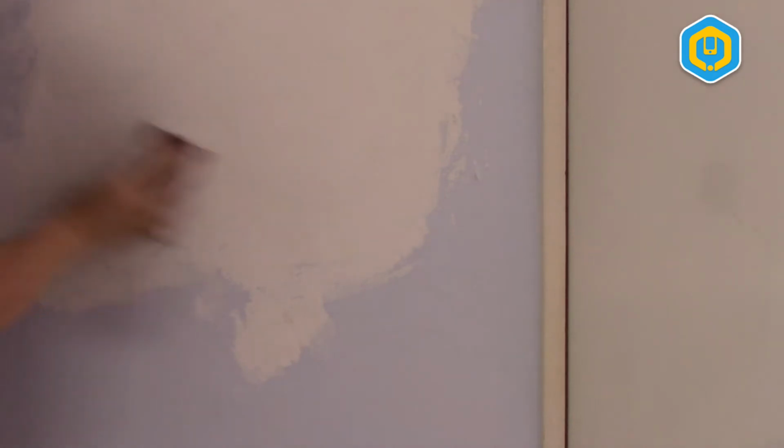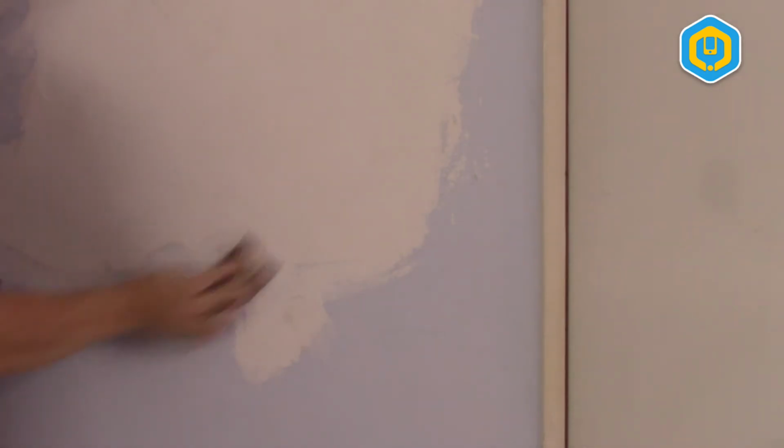Once again, I sand in circles. There's quite a bit of filler dust, so I use a dust mask, especially when I'm doing such a large area. Also remember to put something down on the floor. It just makes it much easier to clean up the dust afterwards. Well, I'm so relieved that this huge hole is filled. Be sure to watch the next video where I'll be showing you how to undercoat this section.